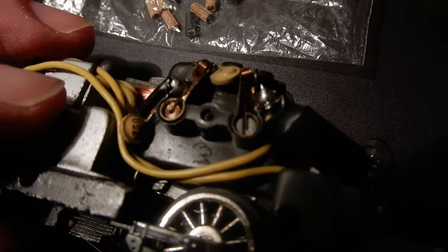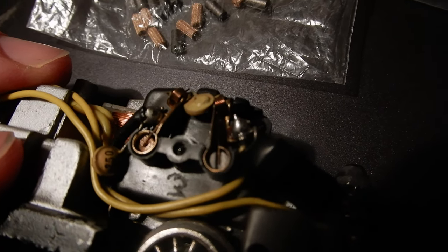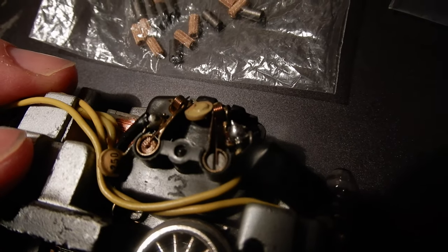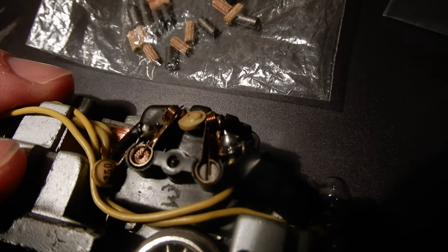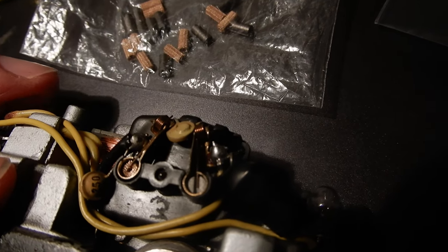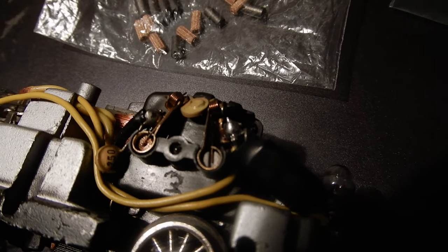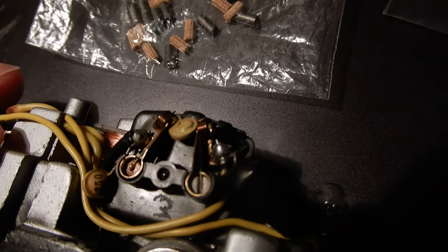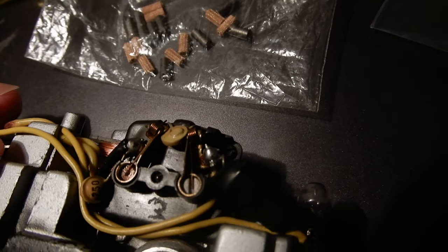Just to illustrate: I am pressing on the axle of the rotor and you can see that the copper one and the carbon one are moving up and down. There is a little bit of side play — this is very good. Over time, especially the copper one has a trend to inflate, and then you don't have the right contact and the right pressure anymore on the rotor plates. This is key to ensuring that you have good electricity going to the rotor of the engine.